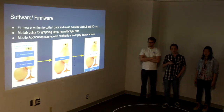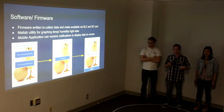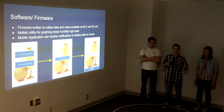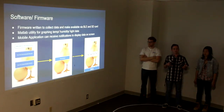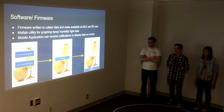For our chicken counter, it basically stays in standby until it is triggered by one of the IR trips or the RFID. Then it has a timer that waits to see if it gets the other IR or RFID readings to know whether to count up or down. But if it doesn't see the other sequence of events, then after a certain amount of time it knows something happened to cause it to trip without a chicken actually walking in, so it clears everything and knows not to count.